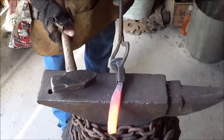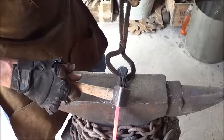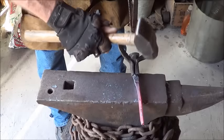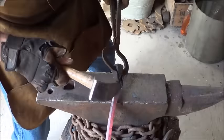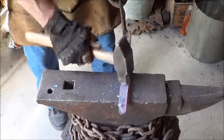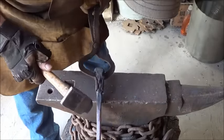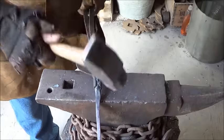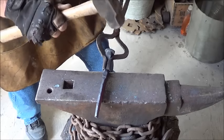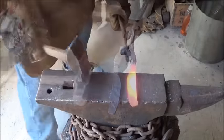Now I want to put this drop in because I want that in there - I don't want it to be a fracture point. So I'm not going to go for the sharpest point on the anvil; I'm going to go for something a little bit rounded. Without messing up my pineapple twist, I'm going to bring that back as best I can. It's a tricky thing to do without messing up your twist, but I want to drop that. Just that little bit of drop will release the tension here as I draw out this blade. I got a little bit of a bump here but I think I'm okay with that. Let's just draw this thing out some more.